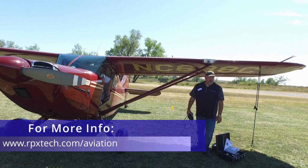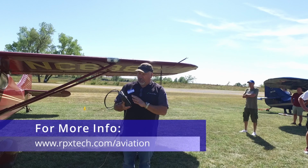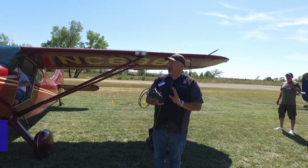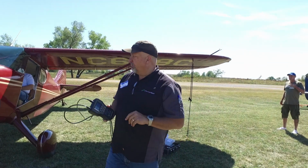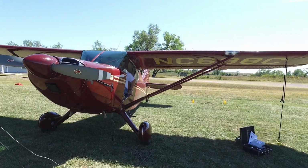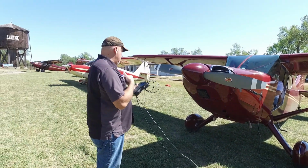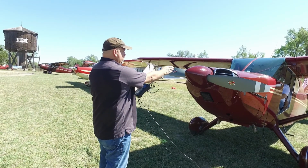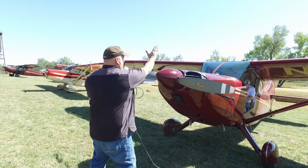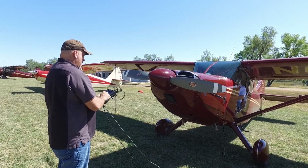All right, everybody, I'm going to talk a little bit about the DynaVibe and setting up the system. When you load it up, there are a lot of little menus. What I'm using is called auto balance. That way it'll automatically calculate the weight based on the first run. There'll be two runs. One of the things that's unique about the DynaVibe is you get to pick if you're on the pilot side or the mechanic side. So I'm on the mechanic side, and I'm setting up where I put the accelerometer. I mounted the accelerometer just behind the front of the starter ring vertically, and so it graphically shows that here. It's got the wire pointing out the top.